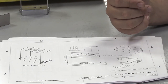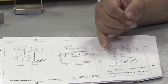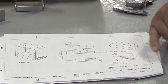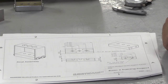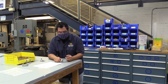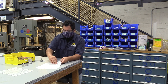Some things to be aware of as we go to cut our holes: what drill bit do we need? The drawing shows a 3/16" bit at a quarter-inch depth — that's a blind hole, not a through hole. The next holes on the side say four 10-32 taps at three-quarter-inch depth. When it says 10-32 tap, that means we need to make a hole and thread it so screws can go into it. I can look at the chart in your packet.